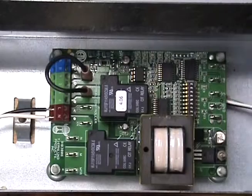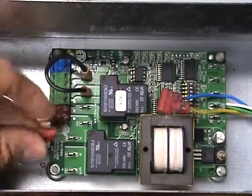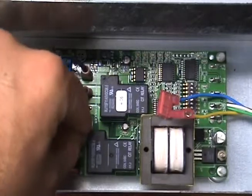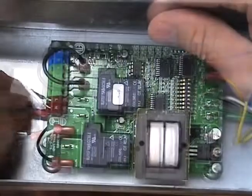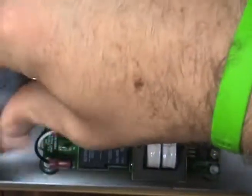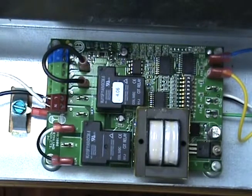If not previously completed, you also need to attach and wire the UC1 whip to the circuit board and to the venter. Carefully slide the black, white, blue, yellow, and green wires — four of which have female spade connectors — into the UC1 cabinet. Attach the black to the MTR terminal and the white to the N terminal. The blue and yellow will connect to P1 and P2 and are not polarity sensitive. The green wire will attach to the box grounding screw.